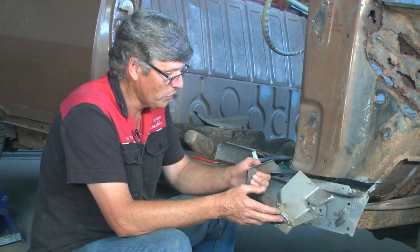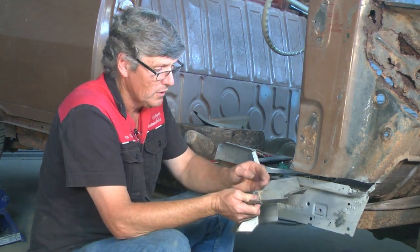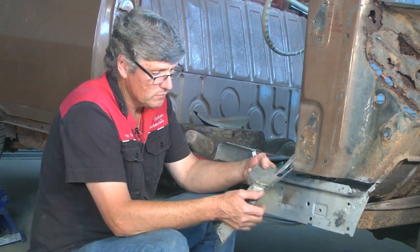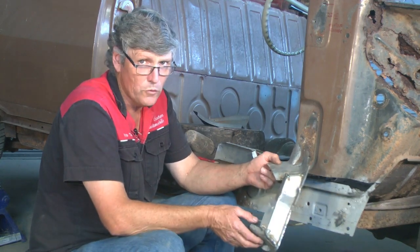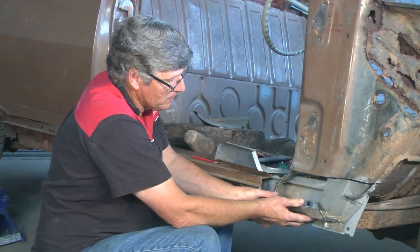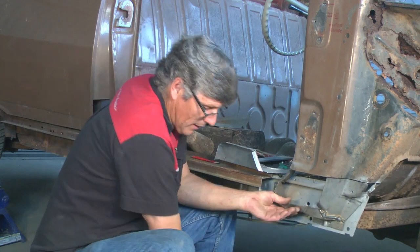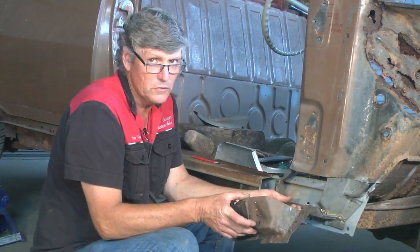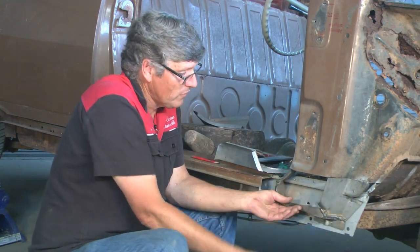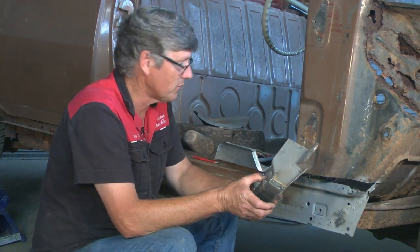But it's still workable. And I've got radiuses into it, I've got curves into it, and this was entirely made with simple tools, but you can see I'm making it in multiple pieces. So from here, I'm actually going to weld it to the bottom of the pillar in the right place, and then I'll be filling in the gaps. I'll be making duplicate sections from the original, and then welding in piece by piece to get the alignment right. So sometimes with complicated pieces, you need to make them in a lot of pieces.